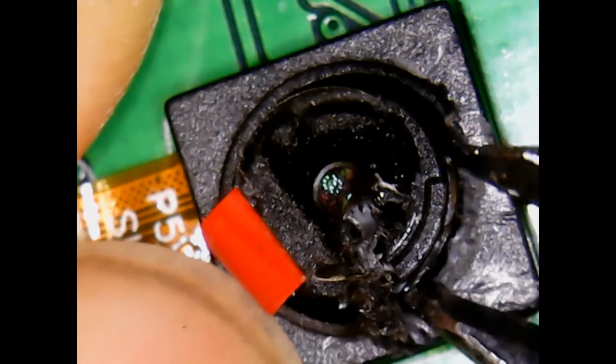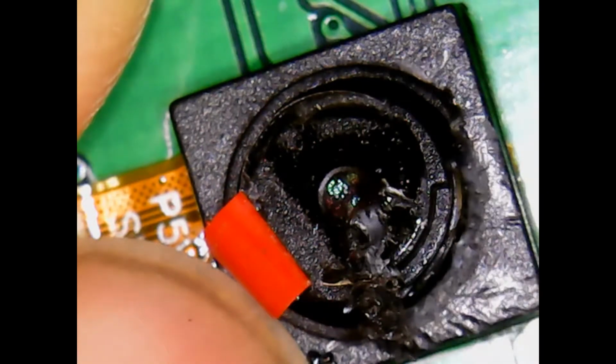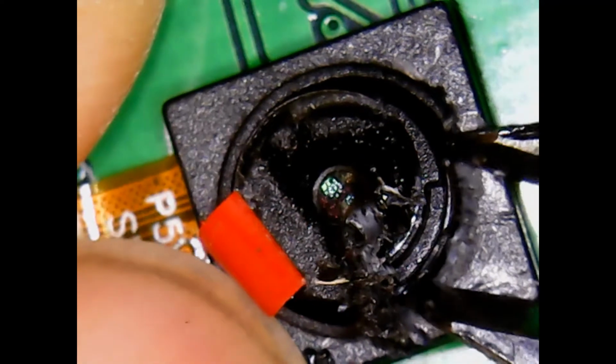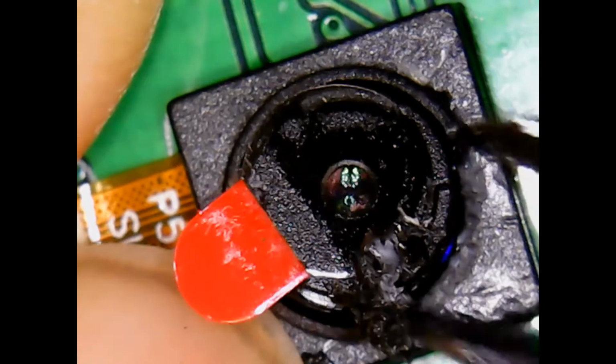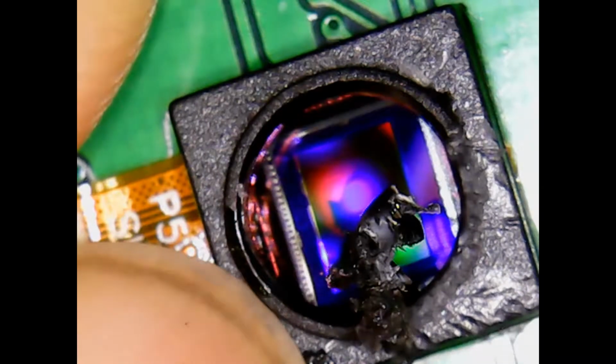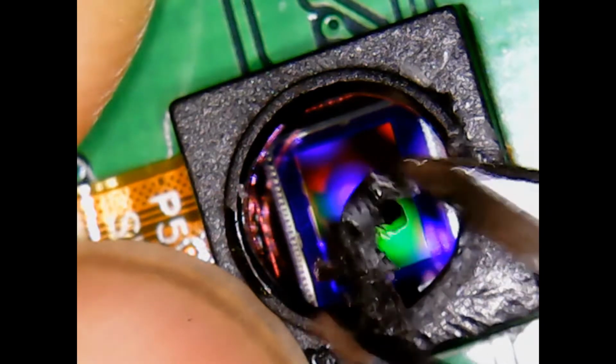So chew around, and when you're almost about halfway chewing, and we move it down here, this lens just wants to pop up, and I'm going to pry it up. Now you got to be really careful that you don't let this tool, which is metal, slip inside there and scratch the glass. So again, very controlled movement. I'm prying it. Oops, it's like a loose tooth now. So I'm just going to grab it and push it away. Boom. Okay, so now the lens is good.